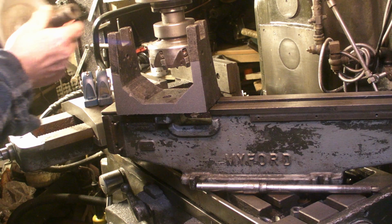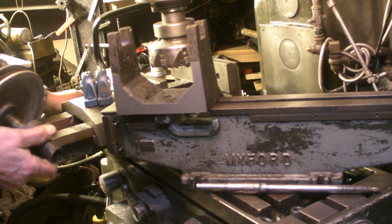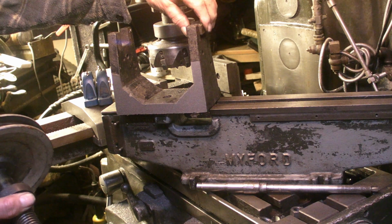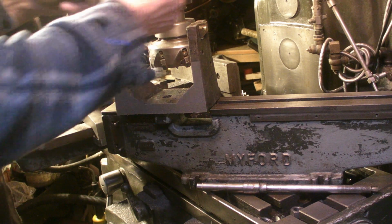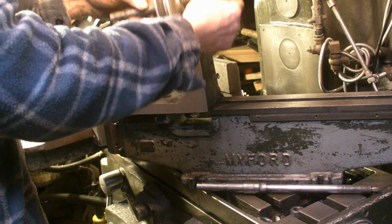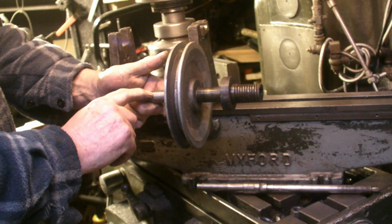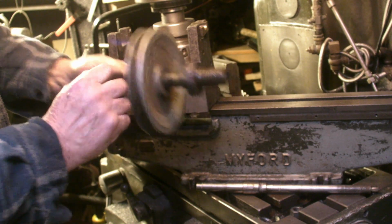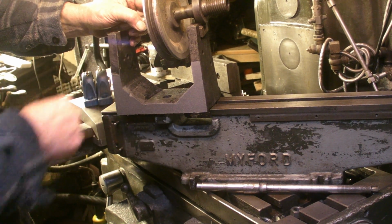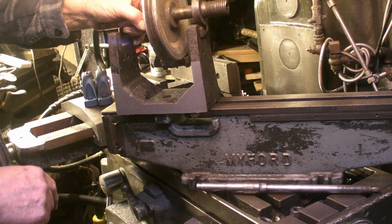When I was using it as a wood lathe, this is a spindle that was mounted on it. There's a couple of bronze bearings that fit into the headstock there, and then the spindle sits onto those and clamps down. So the intention is I'm going to take this pulley wheel off. This centre section will then be the space for the rosettes. So the rosettes will fit into this section. I'm not quite sure how many I'm going to use, so maybe start off with one and see how we go. But that's the setup for that.